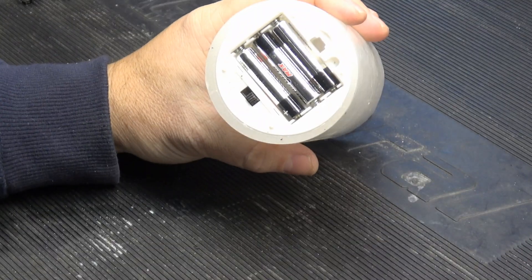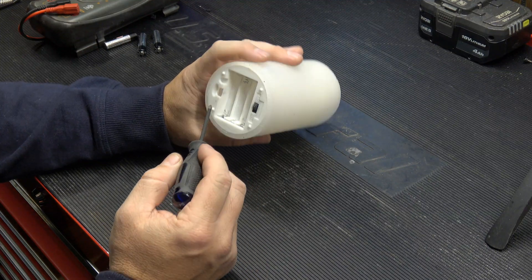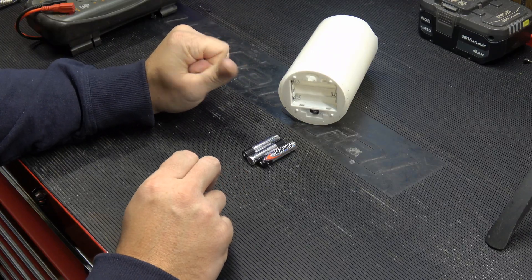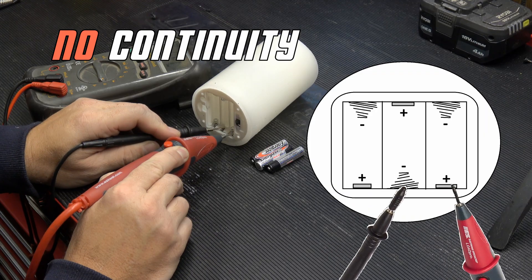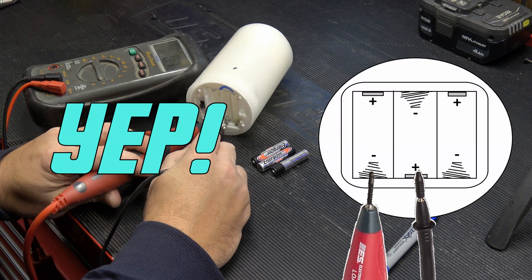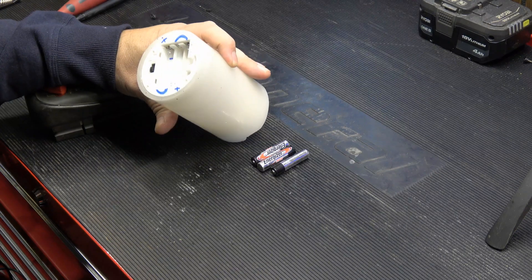So what about our next device? This time we have three AAA batteries. The 3-volt adapter I showed you earlier — is that going to be good enough? Probably not. So we have to think a little differently about how to wire this one up. Just like the last one, the batteries are hooked up with alternating polarity — negative, positive, then folded: negative, positive. What I really need to figure out is which terminals are the positive and which are the negative. I'm going to take my multimeter and set it to continuity. We have continuity between those two posts — no continuity between those, no continuity between those — so these two are bridged together. Flip it over and try the same on the other side. These two are bridged together. So I have one independent positive and one independent negative terminal, and that's all I really need to know.